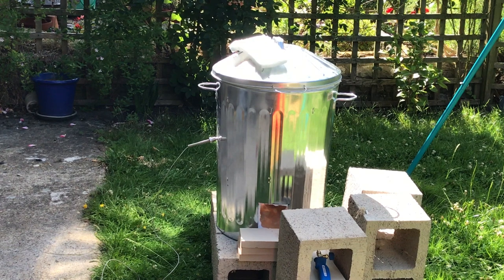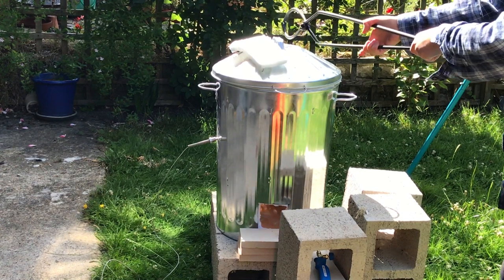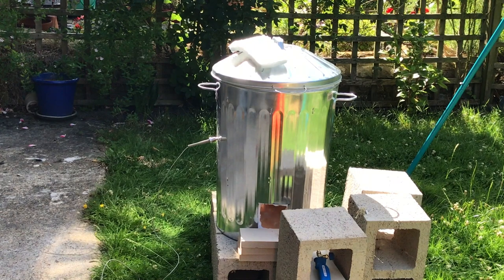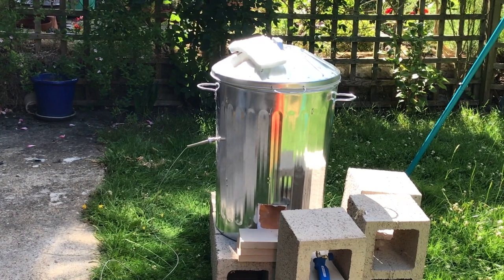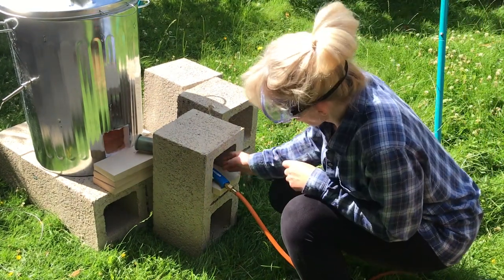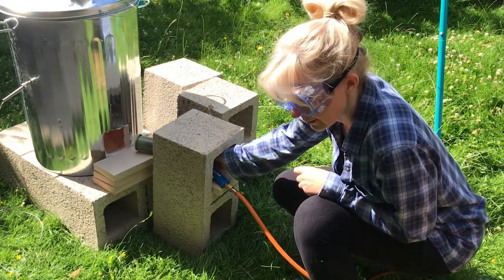The other adjustment that I made was to cover up the exhaust flue on the lid. As you can see I've used a spare piece of ceramic fibre to partially cover up the flue. The idea is to just retain some of the heat — I use ceramic fibre because it's light, flexible, and easily movable. You can contain some of the heat in the kiln but you've got to be careful, because the more you close off the flue the more you're likely to create a reduction atmosphere, so you've got to get the balance right.